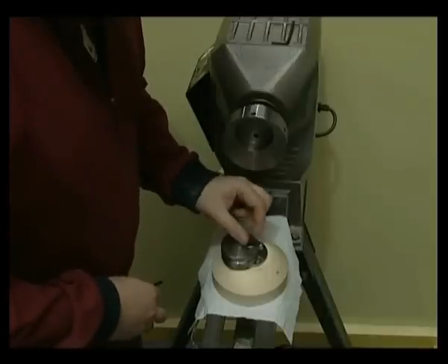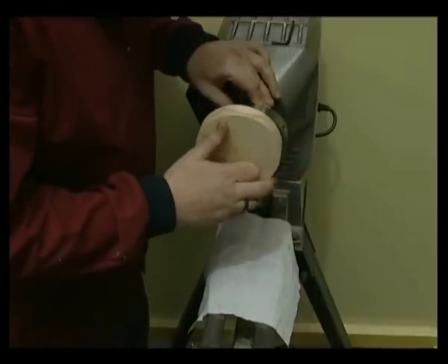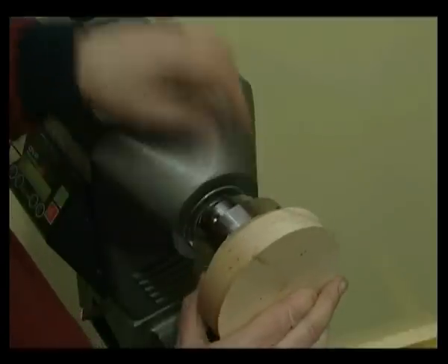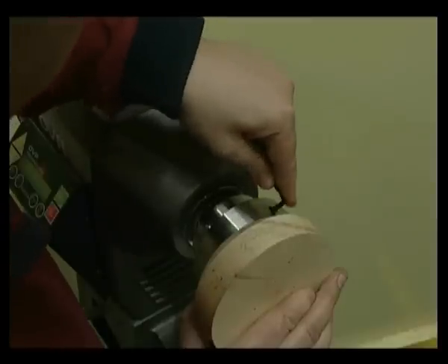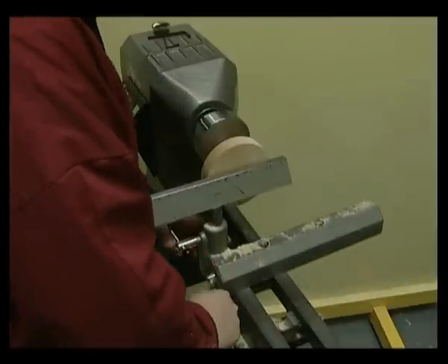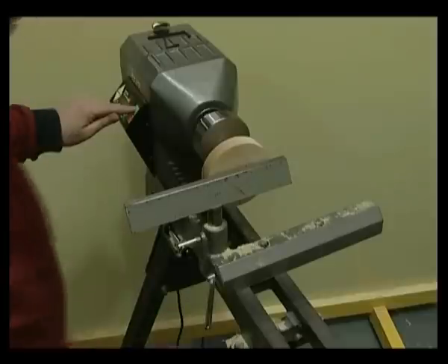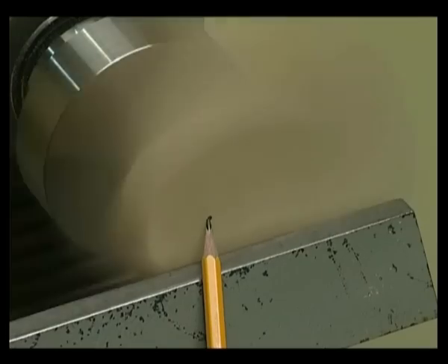Replace it back into the socket and re-tighten the machine screw and washer. Replace the eccentric boss back into the main body. Set to position 35 in the sight window and re-tighten the boss screws. Now the line marked 2 will be in line with the reference mark on the chuck body. Move the tool rest to the safe tool rest position. Switch on the lathe and mark a new centre number 2.